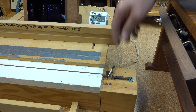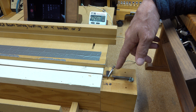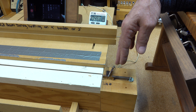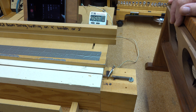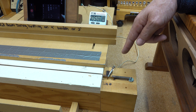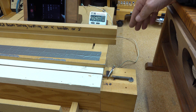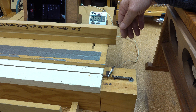You guys need to be safe with the electrical — these are live. Even on a large strip heater you'll have about 35 volts, which is still enough to hurt you. There's no ground connected so be very careful. If the electrical aspect scares you or you're not comfortable with it, don't even get into it — find somebody else who can help you or do it together with a friend. Let me know what you think, take care, and be safe.